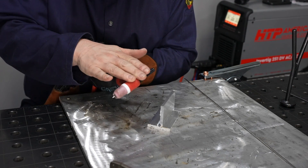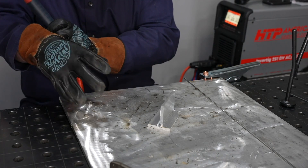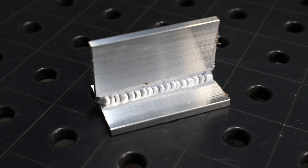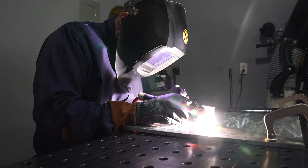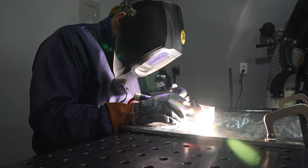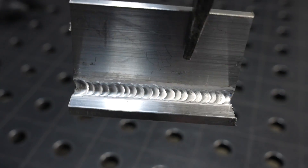Let's take a feel on this torch — I don't want to touch that cup for sure, but the torch itself is just warm to the touch. It's really not too hot, which is impressive for running 250 amps AC on an air-cooled torch. The weld came out nice and clean. I'll also weld the back side — I can scoot along a little bit faster with the preheat left over from the first bead, and the weld came out pretty similar on either side.